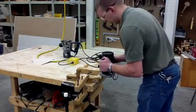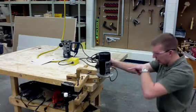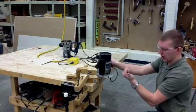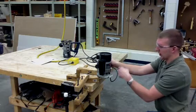So I always tell too, if it helps, to kind of get down and see what's actually happening. So here's my line. I'm going to end up looking through the throat of it. I'm going to turn it on, I'm going to press it in, kind of work back just a little bit to that line, and then take it 1 quick pass all the way to the line on the right-hand side that I made.